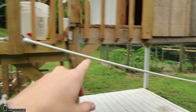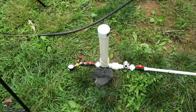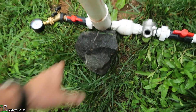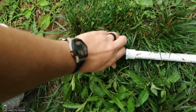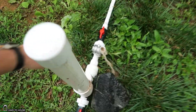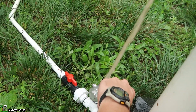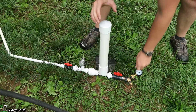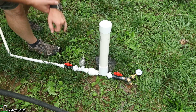Here's the new setup. Same bucket comes down, makes a 180, comes back down here, hits a 45, and then over to the pump. If this starts, we will find the pressure and then count the cycles as it goes. Start the water back here at the top — it's going to fill that pipe, come down here. It's got some dirt in there and some air. Hopefully that's all the air out of that. Let's go ahead and start our test. I've made sure the pressure is out of the pressure tank — that's just water flowing straight through. As soon as it starts cycling, I will begin our timer.